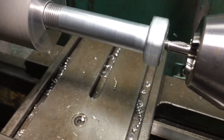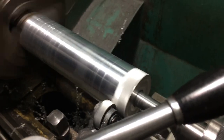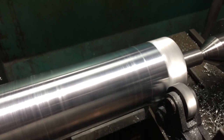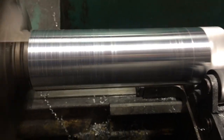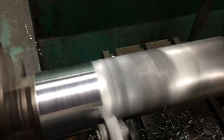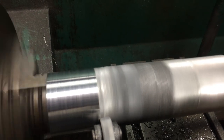I'm trying not to make these videos so boring. I won't film this for too long. See that — I'm knurling. It's getting knurled. I'm also going to concave it, but that's a bit above my pay grade — I'm just going to knurl it. That'll give it the grip that I want. Probably go up and back a couple of times. Put a bit of oil there — that's why it's a bit dirty. I'm going to stop it and then go back and reverse, sort of like braiding it. Just go back and reverse and it'll give it a nicer job.